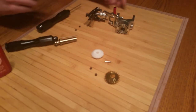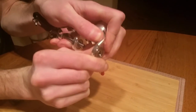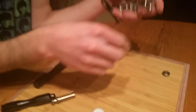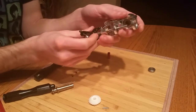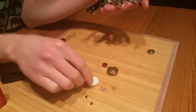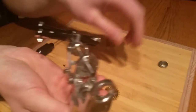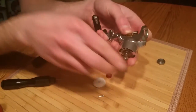Let's put the old gear to the side. The first thing you're going to want to start with is popping this bearing out. If it doesn't come out easily or you can't get it out, you're going to have to apply some heat — just take a lighter, something just to warm this up, just to get the Loctite or any of the bearing glue loose. The next thing we're going to do is take our red collar, this gear, this gear, and our pin. We're going to take the shaft, slip it through halfway just until it's below the bearing, take our new gear, and slide it in.